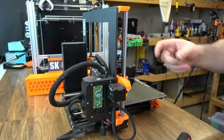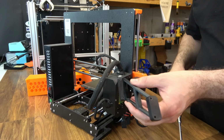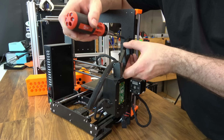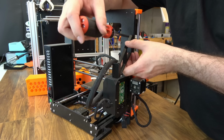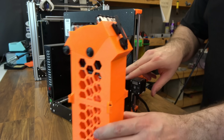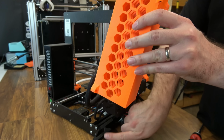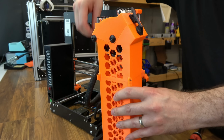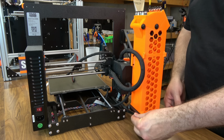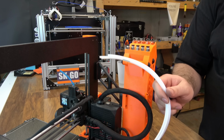And the top bracket actually goes in a couple of holes that are already on your Prusa machine. So it's the side of this bracket that doesn't have the nuts loaded. It just goes right here. These are threaded holes. M3x10mm screws. And then your buffer, these two are going to set right here on that top bracket, right in these. And then there's 2 on the bottom that go in the 2 holes on these bottom bracket. And those are all 4 M3x20s. And then on this side of this bracket here, those also have some M3 nuts that go inside that plastic part.